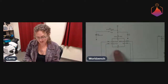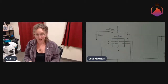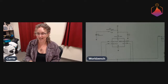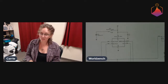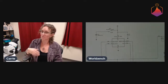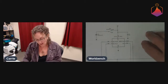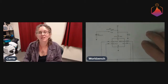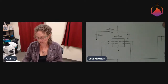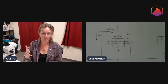So it is ATtiny4 controlled, like many of our things are these days. Go with the processor that is in hand. That is what you do right now, because oh my God, chip shortage is real. We had some ATtiny4s, and we just actually got more because DigiKey happened to get some more in stock. So yes, we are ATtiny4 rich. It's a 33-cent processor. It's a SOT-23-6. So you basically have power, ground, reset, and 3 usable pins.